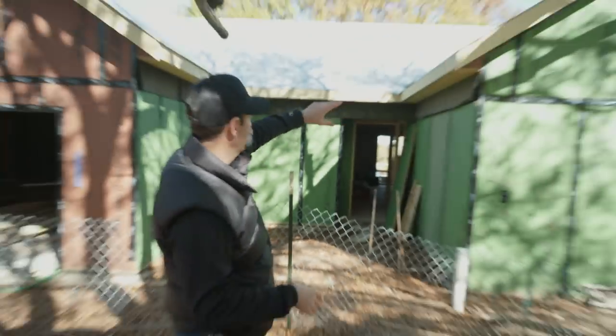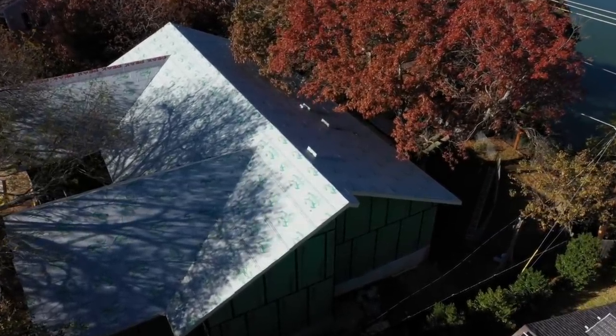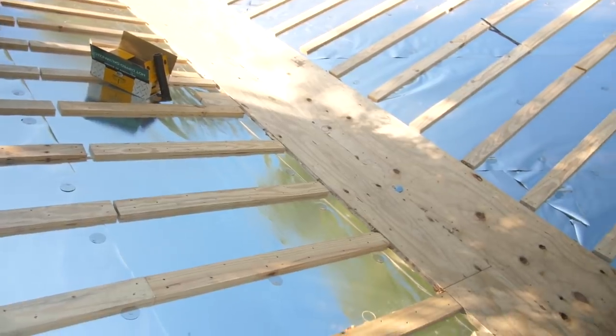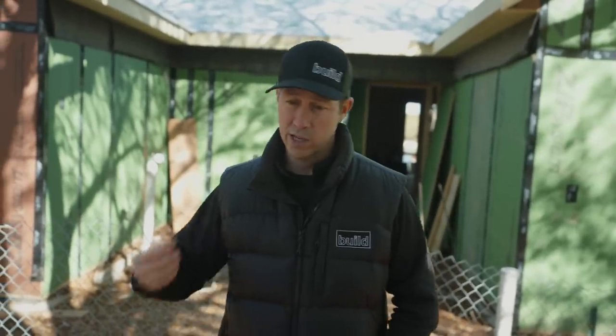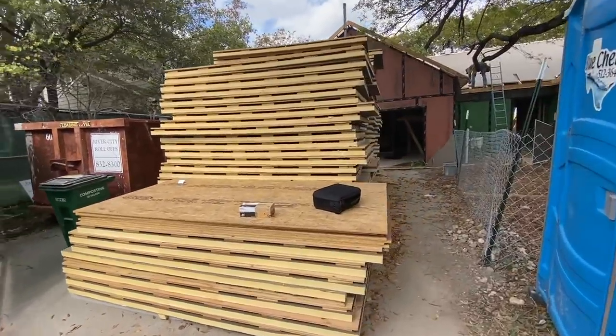Eventually we're going to put a metal roof on this house, and that metal roof will go right on top of my roof deck. I've already put my underlayment down — I'm using Sharkskin, which I've found to be a really solid underlayment, specifically their peel-and-stick version: Sharkskin Ultra SA, or self-adhering. So now I'm waterproof through all of construction, and when my trades get through, I can come back and put my metal roof on. In the past I'd put my metal roof up on 1x4s to create an air gap, but with this system I don't have to do that anymore — that's why I'm calling this Monopoly Framing 2.0. The venting underneath my roof deck gives me a little extra forgiveness. If I ever have a roof leak, it's going to be able to dry in there, and it's saved me labor, time, and materials.